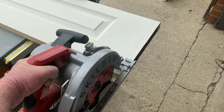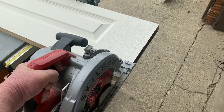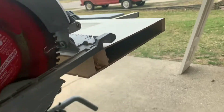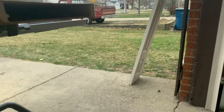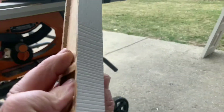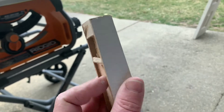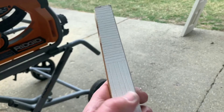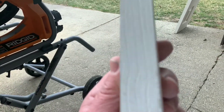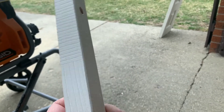If you don't have experience running the saw, I'm going to spare you the noise. As you can see, I've already done a sample cut to check that my blade is sharp, and I've taken out the plug. See, they only give you a little plug that's maybe a little better than an inch. If they were worried about installers, they'd put a nice two-by-four plug in here so you'd have an inch and a half plug and could cut off this much without having to re-block the door.